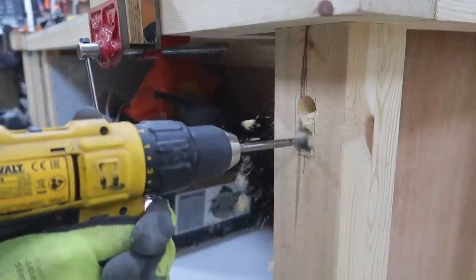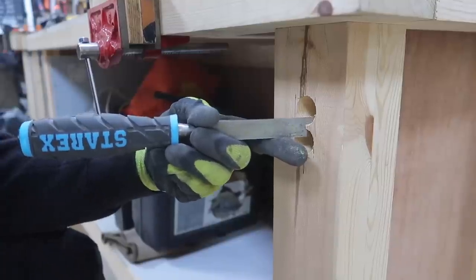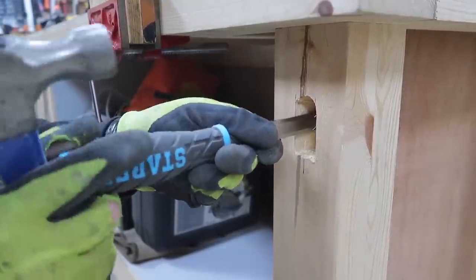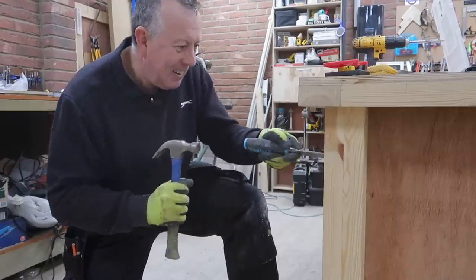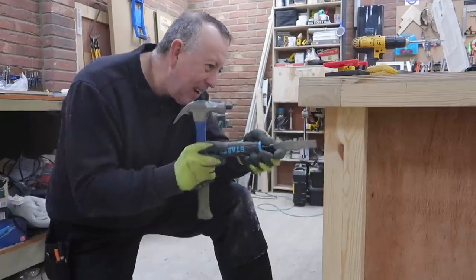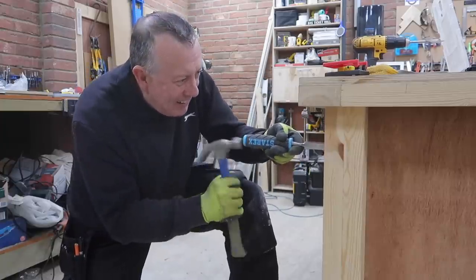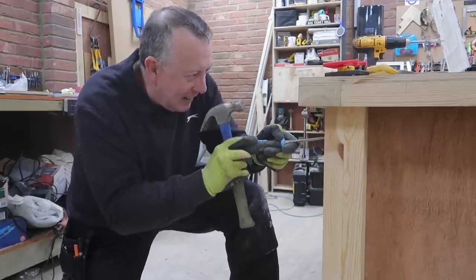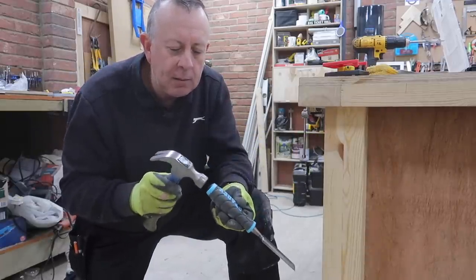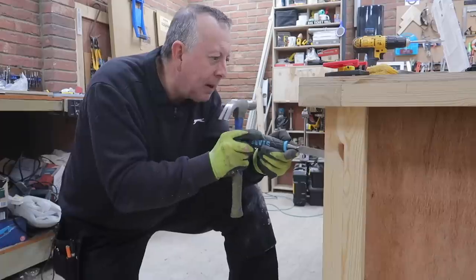If you don't have a leg on your workbench of this size, I would suggest making a small box out of ply or MDF that the switch can fit in and then can be mounted conveniently somewhere on your bench. Before anyone says anything, this chisel is what's called a through tang, which means the metal is continuous through the handle with a rubber grip around it — meaning I can use a hammer before anyone starts writing in about mallets.